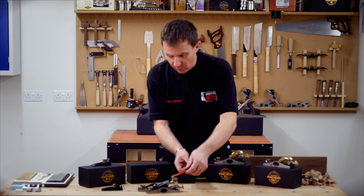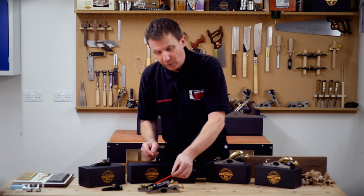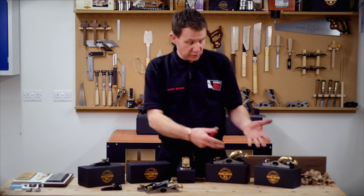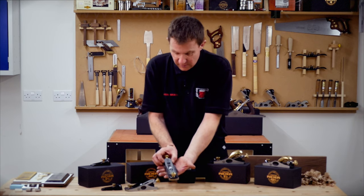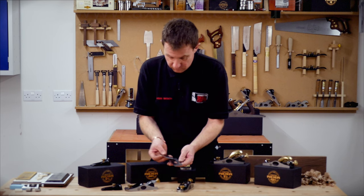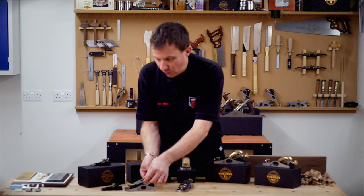The major difference really is how the blade is sat. This is a higher angle, this is much lower. So we're looking at the blade angle — this one's higher up. That's the major difference between the two ranges. The deluxe is more to do with the polished brass. The next difference is this has the narrower blade, different width, depending on what you're planing.